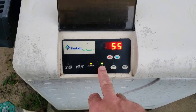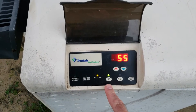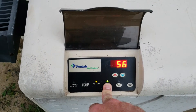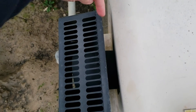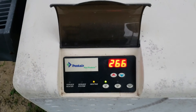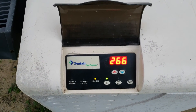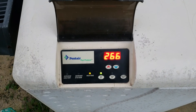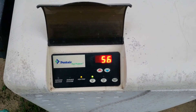So while this is heating — if you've got it programmed to be heating the pool, that light will be on; if the spa, that light will be on. Right now it's the spa. If you hold that button down for five seconds, that'll show you the temperature that your stack flue sensor is detecting on the side of your exhaust pipe. It's running 266 — this thing usually settles around 290-295. It's still heating and hasn't turned off at all yet, so I've definitely fixed my problem here. I'm already gaining temp. Alright, I'm going to go ahead and cut it.